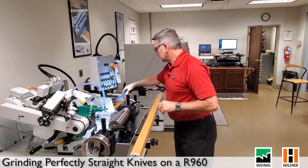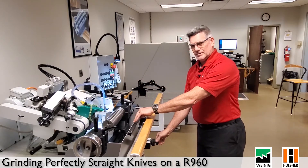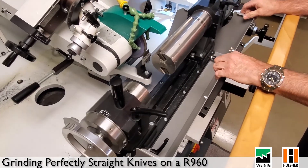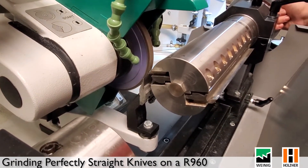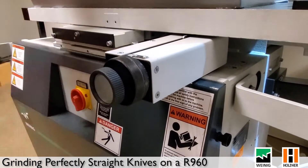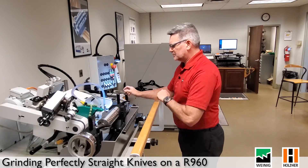What we do now is on all of our grinders we have what's called a straight knife clamping unit. So anytime the grinder can make a full circle, when we're ready to start doing the grinding on a straight knife we simply get it up into position near the grinding wheel. We turn the handle a half rotation or quarter of a turn, lock it in, and then we're going to just simply ride on the tool rest as we traverse.